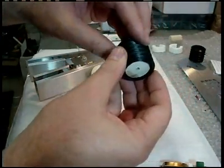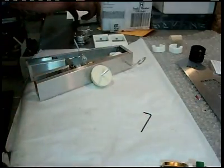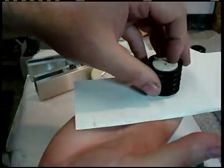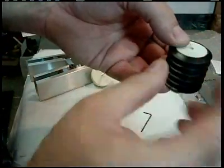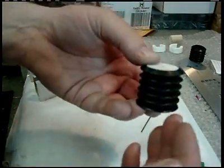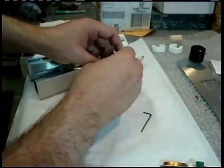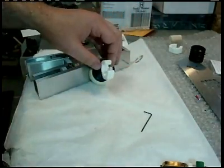And when it gets down near that end, I just set it on something. You wouldn't want to set anything good, a piece of wax paper, a plastic bag, you know. Set it on something and just push on the dowel and wiggle that, and just leave it that way to dry. That way when it's dry, the dowel is going to be flush right with the top of the bellows. It's going to be real easy for you to spray paint the bellows or paint the wood to match the bellows or whatever you want to do. But at least then they're all one. So when it's on there, it looks good, and it isn't going to be sliding around or acting funny on you or anything like that.